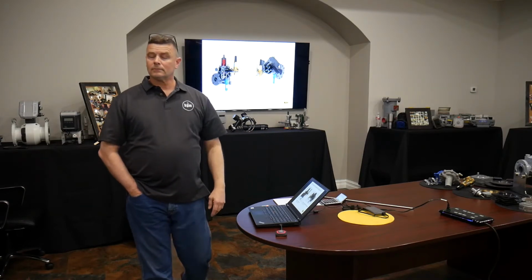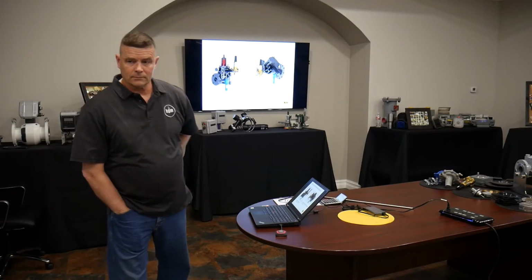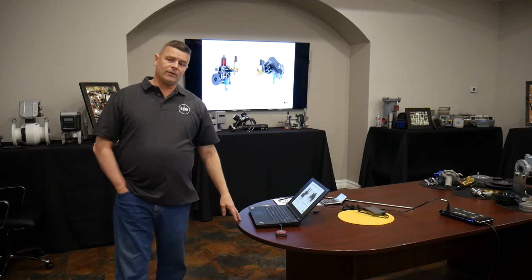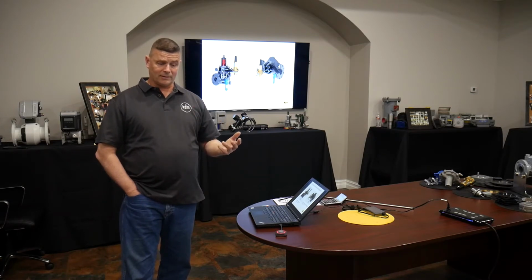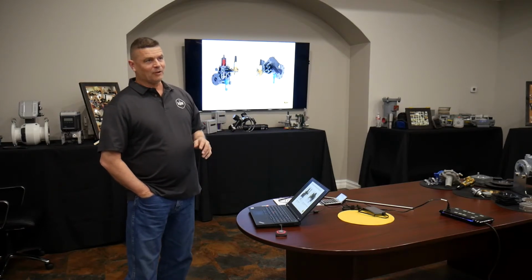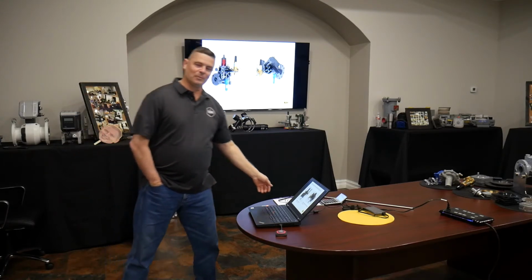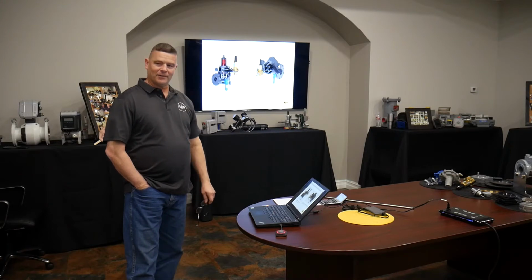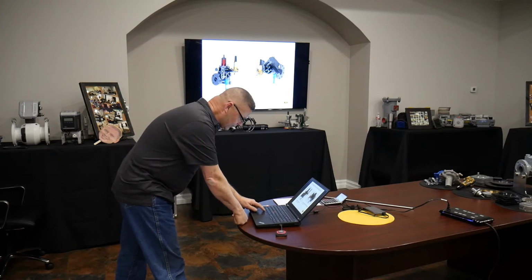Hey Jeff, on the 1,500 psi under emergency conditions, is that within a certain time frame? Like, does Mooney recommend it needs to be dropped within 30 minutes, an hour? I haven't seen a time component listed with that, but I certainly think it should be as short a period of time as possible. It shouldn't be, well, okay, I lost my upstream regulator, I'll just go till next year and then I'll rebuild it. No, as soon as possible. It's come up recently. Did it? Yeah. That's something we can engage Ken Graff on, and see what he gives us back. He's always a great resource.